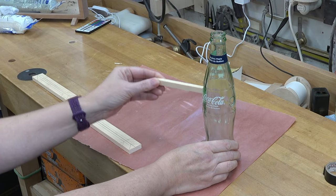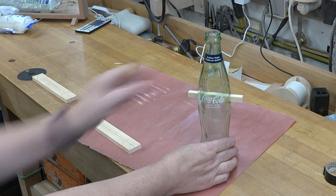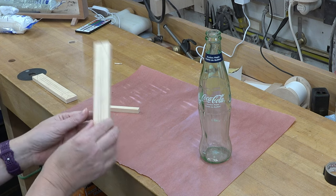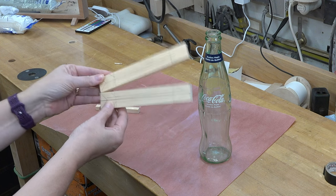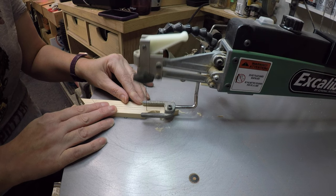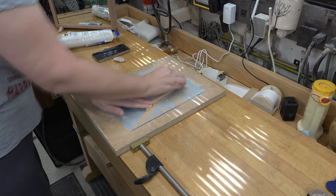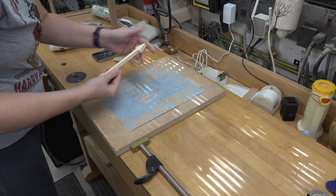So we've tested putting some stock through the holes in our bottle and found that we need a shaft on the arrow about 3/8 by 3/8 of an inch. So on some 3/8 thick stock, pine in this case, we've drawn out some arrows and we will just cut them out at the scroll saw as best we can. You now want to give your arrow a good sanding front and back and get any of the burring off from cutting it at the scroll saw.